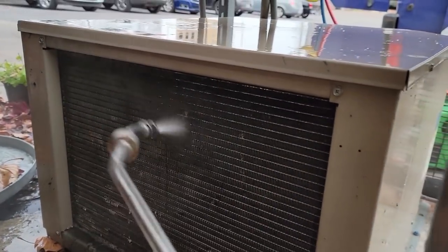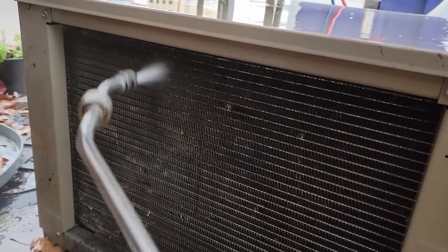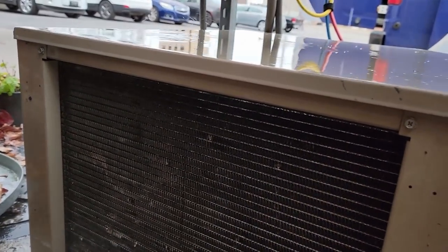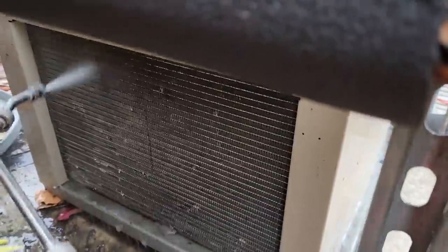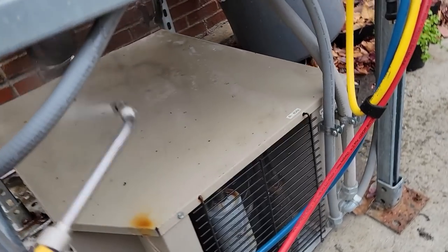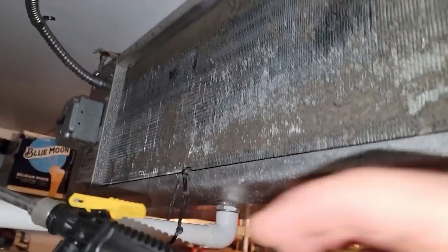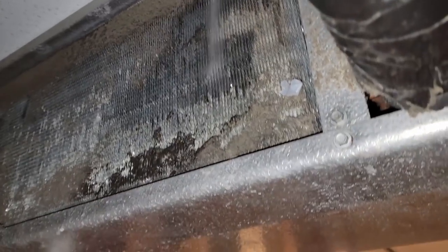I gotta admit I'm a little leery about doing this because they aren't having problems with it, but if it's low it's going to show up now that I've cleaned it. But it looked so bad I just couldn't let it go. If I did overcharge the top one — which I don't think I did — this thing was completely plugged full of crud, so you can always dump the remaining overcharge into this unit if it is low. You can adjust that spray pattern on the end there. As you can see, we're not damaging those aluminum fins — it's doing a really nice job. We did both coils and we still have some water left, which is kind of nice.